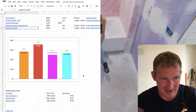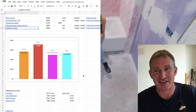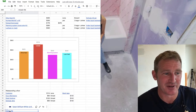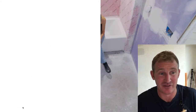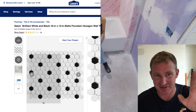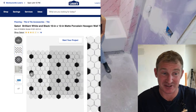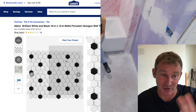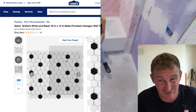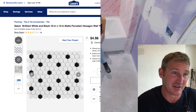And I know this is a waterproofing video, but you have to put it in context with what you're actually doing. These mosaic tiles are really the crutch of the whole design feature of this. If you don't plan right on this, you can really make this a tough job on yourself, because this doesn't have a lot of flexibility for you. It needs to be flat. You can float it somewhat, but then you're fighting all the thin set coming in through the bottom.